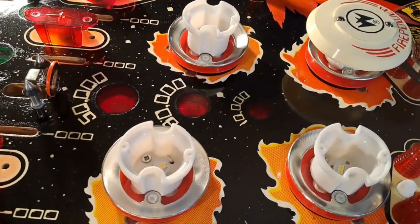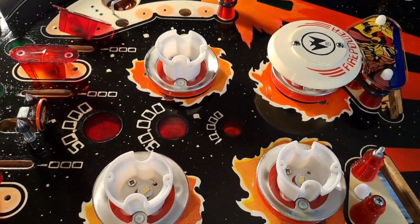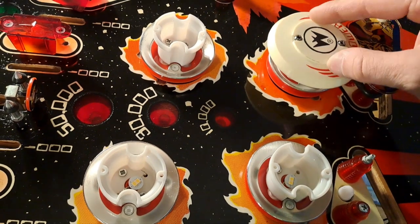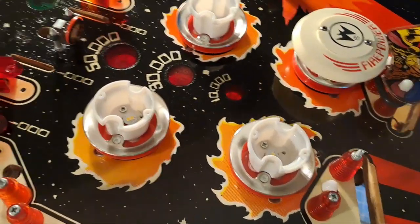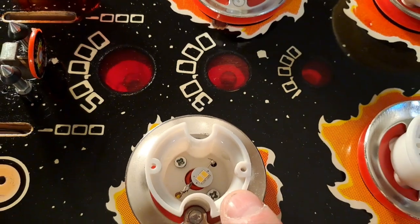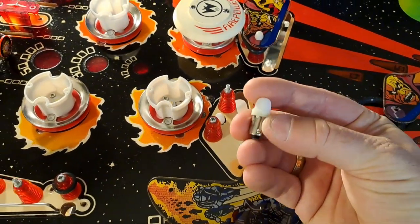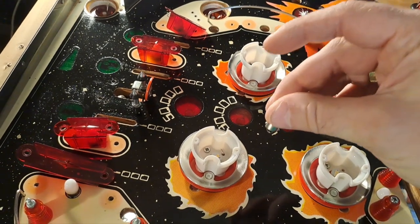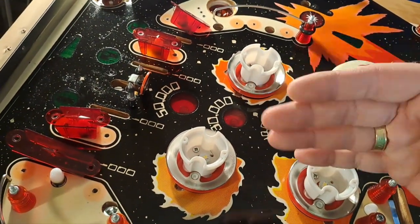I want to show something with the lighting and give credit where credit's due. If you go on YouTube, there's a channel called District 82 Pinball — he's got some really great content, how-to's, and different things on how he rebuilds machines. One of the things I liked recently was how to do the lighting in your pop bumpers. Normally a lot of these machines have a bayonet-style socket, which are really terrible because it works on spring tension and just barely hugs the side of the bulb, so with all the vibration of a pop bumper, the bulbs constantly go out.